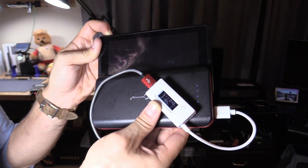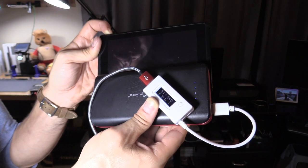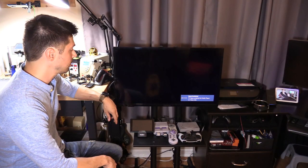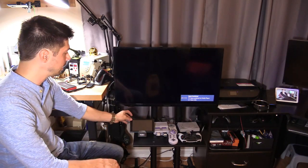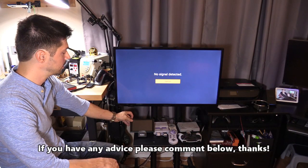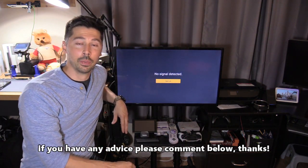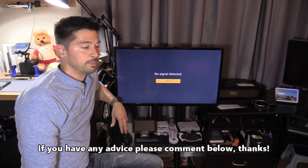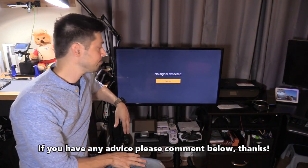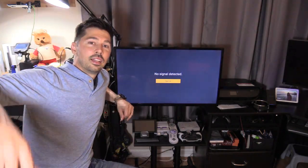It could be something else wrong with the Nintendo Switch, but I didn't read any shorted capacitors — the fuse is good, capacitors are good. Maybe it's a bad IC but I can't check that. HDMI 3... no signal. Press power button — nothing. I'm gonna put this on eBay and see if I can get my money back — I'm pretty sure I can. This one is a fail. Like if you liked it, subscribe and hit the bell notification to stay updated on these eBay challenges. Thanks for watching, guys!